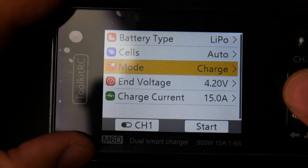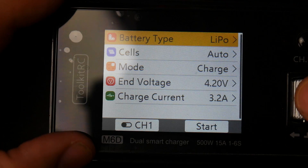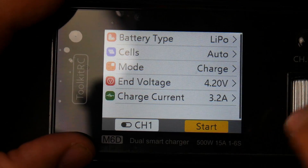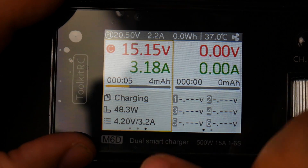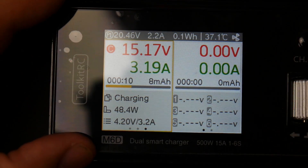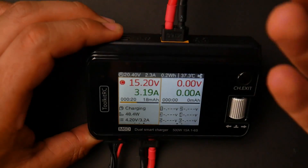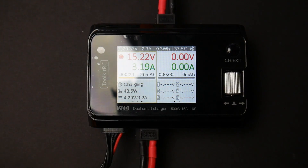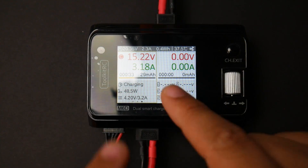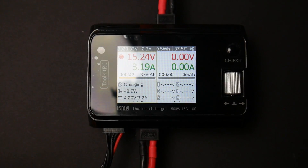Let's go ahead and actually charge. Going to charge mode — charge current at 3 amps. I have a 5S battery on top and a 4S down here. It automatically picked up the 4S — charging to 16.8V, perfect. We can see it's starting to charge at 48 watts, and this thing is rated for 250 watts per side. The fan hasn't even turned on yet. Its main selling point is the dual interface — in the field, I'd connect my car battery via XT60 to alligator clips and charge parallel charging boards with 6S and 4S batteries. Its strong point is high-amp charging portability with two channels.